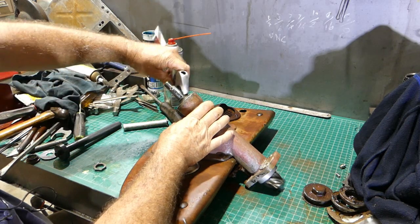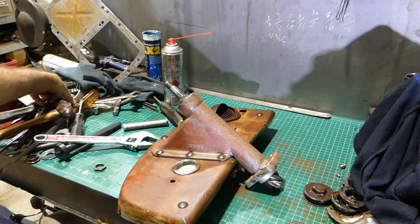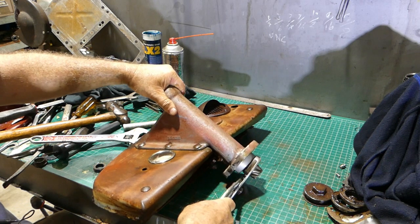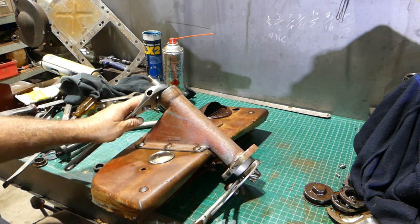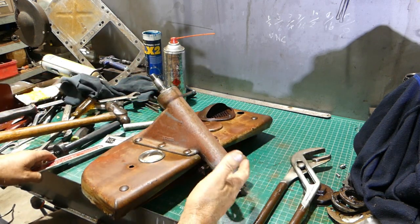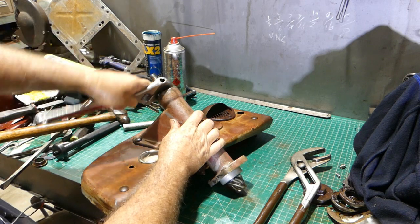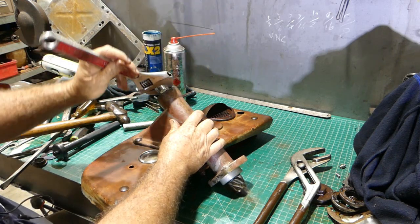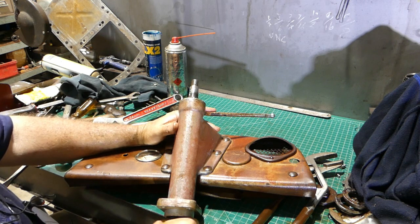Notice that's nice and quiet in there — so that's straightened it up. I'll get the grips once more and hang on to this gently, then go a bit tighter than we should. By over-tightening a little and turning, we make sure all the needle rollers are sat in their happy spot. That actually loosened just a little bit as we were doing that — it feels good, but you can feel that's just a little too tight.